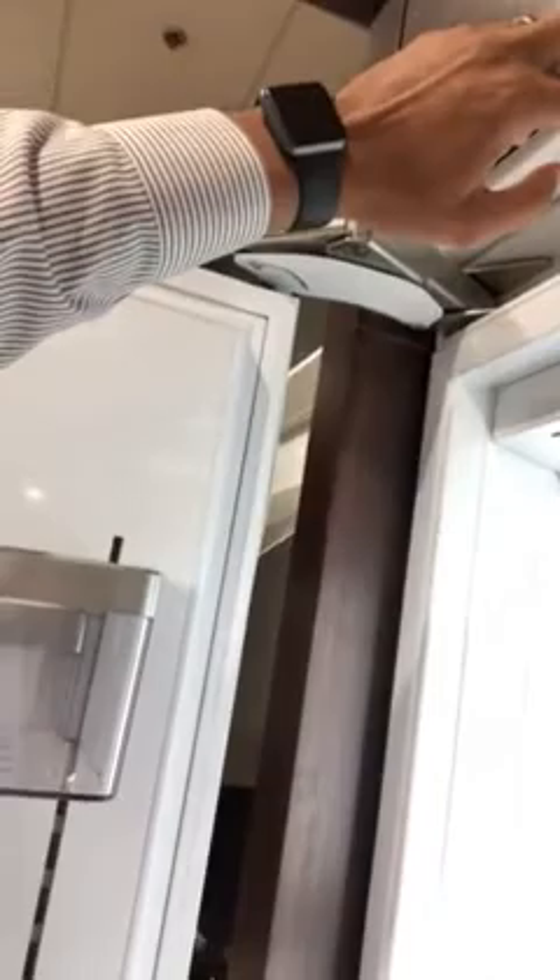On this particular one you'll see three panels, and the return is finished because it's exposed — we want to make sure you can't see any raw finish. We also want to finish up top because that's how it attaches, so a frame cabinet needs to be skinned underneath there as well. The cabinetry specifications really need to be paid attention to — you just can't do the old traditional 24 inches and throw a fridge in there; a lot of detail has to be thought of.